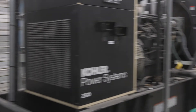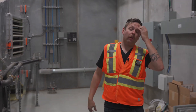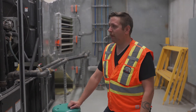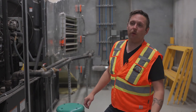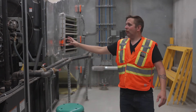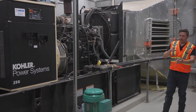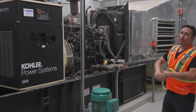A big part of any lift station should be a backup power source. If your power goes out, your wastewater won't stop — chances are you have a backup power source on your water side and that'll continue pumping. We have other remote lift stations where we're able to tow a generator and plug them in with a cable. This backup generator kicks on automatically in the event the power goes out — you can see the scale of it, it's a monster. We run checks monthly and bring someone in annually to do the oil change and test everything.